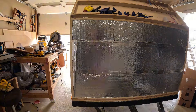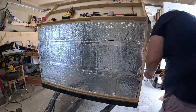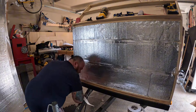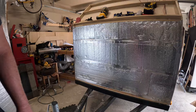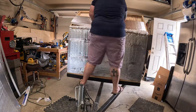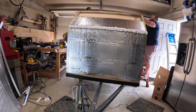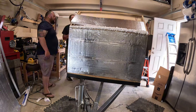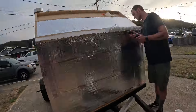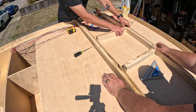We had to work in the cramped space of this two-car garage that has a 4x8 workbench in it — not really ideal, but Ryan was only here the rest of that day and then he left the next morning so I wanted his help as much as I could. I'm unscrewing all the pocket hole screws from the side and then using a router to flush trim the blocking which was sticking out just a little bit on both sides. Now I'm taping up with foil insulation tape and then putting in the spray foam for a weird little gap, then continuing with the insulation. Ryan was busy with the top section continuing with the spars while I was working on the insulation.